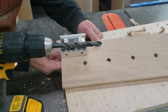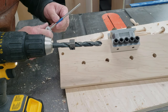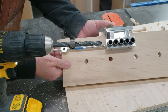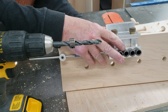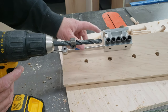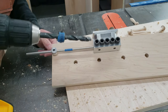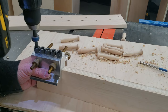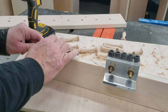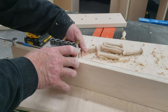Once I'm done cutting the holes for the pegs, I'm going to use the Dowel Max to put the dowels in that are gonna hold the shelf. First I'm doing the actual face, and then I'll come over and do the edge of the shelf itself. After a quick changeover of the jig — just changing the waist orientation — we'll do the edge of the shelf now. I think we're going to average four to five dowels to hold this on, which should be plenty.